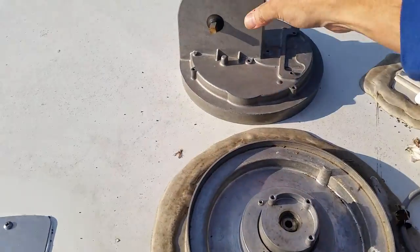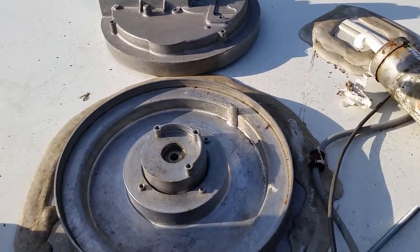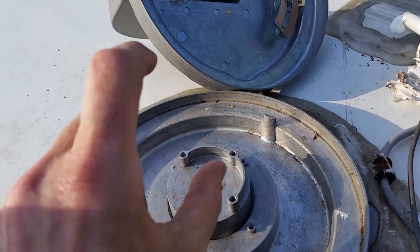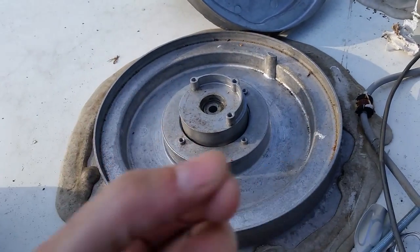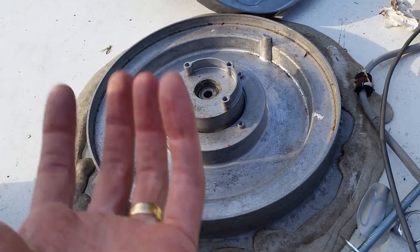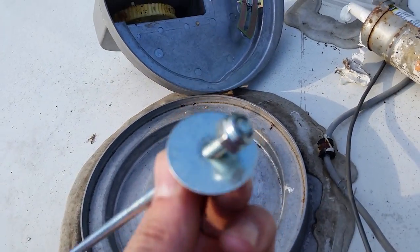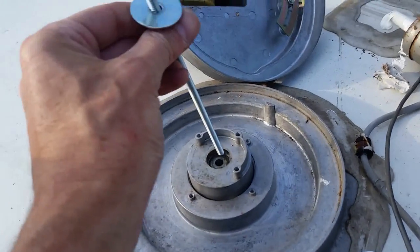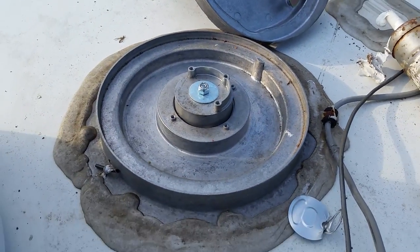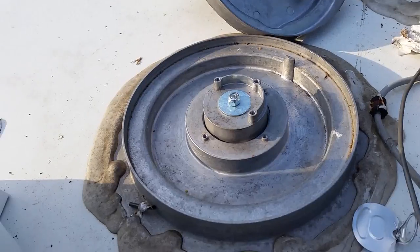I wanted to eliminate this big goofy thing sticking up - didn't want it to block my signal, didn't like the way it looked anyway. Originally it had this big long hexagon shaft sitting up here with a big gear on it that cranked the satellite dish up and down. I've eliminated all that, but I still had to make something to fasten this because I can't take the inside part off. So I made this little doodad - I had to improvise. I just took a piece of all-thread and lock nuts. I'll drop it down and it'll look original, like nothing's been removed.